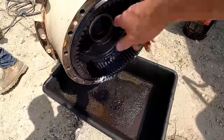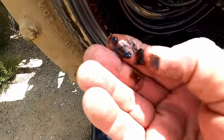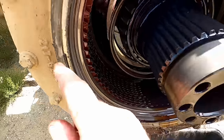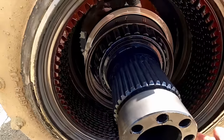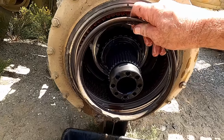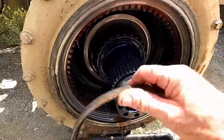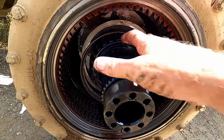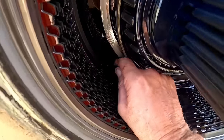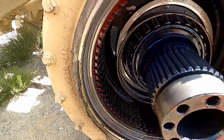Now that we have it off, we'll pull this hub out to inspect the wheel bearings. Here's the brakes — look at all this crap right here. That's all brake material, so yeah, we confirmed it was a failure in these brake discs. We'll pull this plate off and un-stack everything to see what's going on. Here's the inner lifetime seal — the smaller one keeps the 90-weight oil in the differential section and planetary, and keeps it from going into the hydraulic oil in this section. Everything inside this seal is gear oil; everything outside is hydraulic oil. Look at this brake right here — you can see this piece coming off. That's part of the buffer on the inner plate. The inner and outer plate have a rubber buffer, and that's what that is.